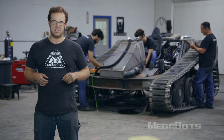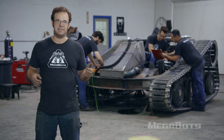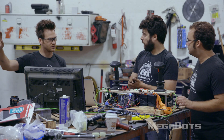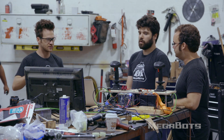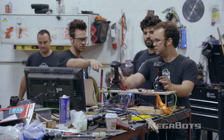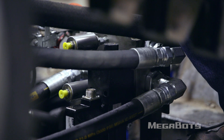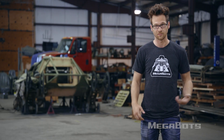John just finished installing our custom valve manifolds and Miles wired them up. So now we're throwing Matt in the hot seat because we don't have a crash test dummy, and we're going to start the process of becoming a robot. The freewheel valves are not energized, meaning they can pass fluid. You have to be a little careful bringing up any hydraulic system for the first time, because it's the first time those hoses and fittings are seeing pressure. Hoses can burst, fittings can break, and it can really hurt people.